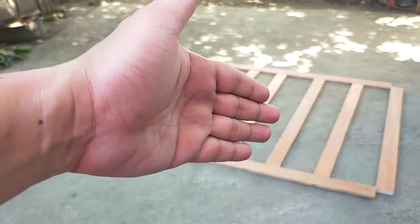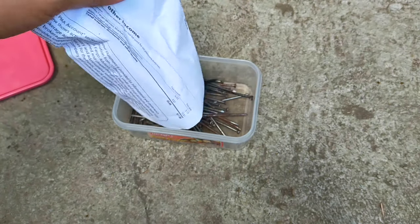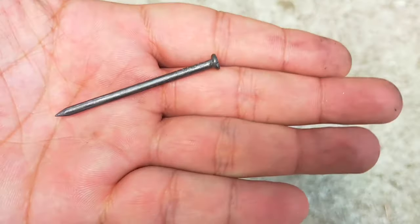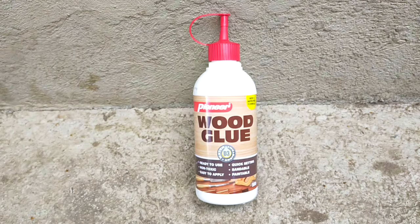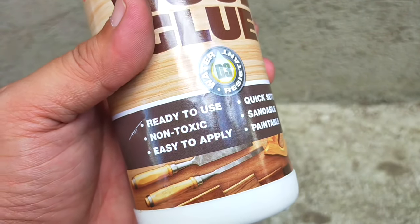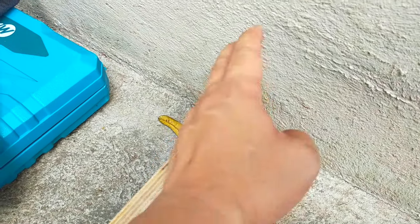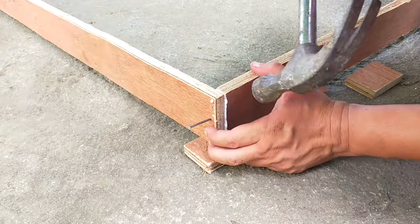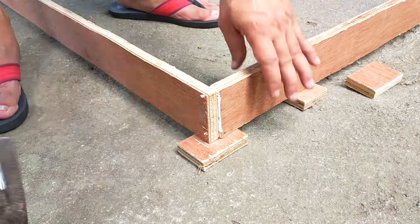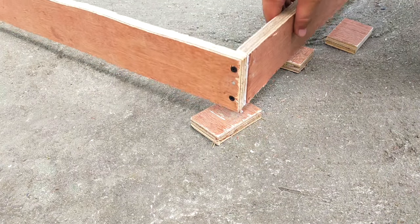Today is day two, and I've laid out all the pieces that will form the shelf's outer frame and the inner vertical panels. The goal was to stand them up, make sure everything was squared, before joining them together with three types of fasteners. First were two-inch nails to hold two pieces in place while still allowing angle adjustments. Second were two-inch wood screws to lock in the joints. And third was wood glue, which would bind the pieces together permanently and seal off any gaps. Because I was working alone with no one to hold the pieces, I used a wall to keep the panels upright and absorb the hammering impact. I applied wood glue where the outer frame side and bottom panels would make contact, held the pieces together with a nail in the middle, then after adjusting to a 90-degree angle, drove in the wood screws on each side. This approach ensured each joint was strong and steady.